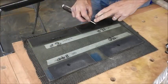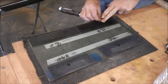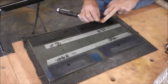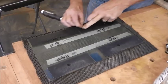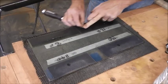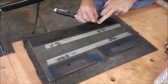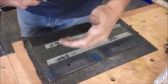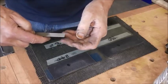So I'm going to go on to the 120 grit. We've got it flat, now all we're doing is polishing it really. I'm now holding the chisel in the other direction, so that any lines made by this grit will be at a different angle to the previous grit. We're now looking to have all the abrasion lines going at this new angle, and to get rid of all the ones from the previous angle. That's looking fairly good.